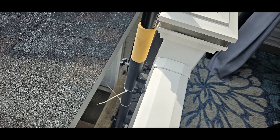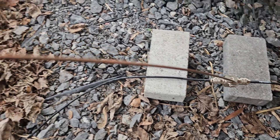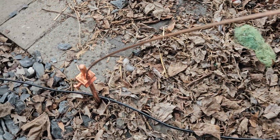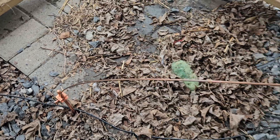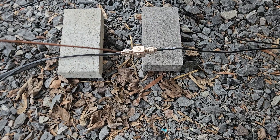Last on this is grounding. This is a ground we have set up — it is a copper rod with a lightning arrestor in it. That lightning arrestor connects into the ground rod and will send lightning downward if it were ever struck. One of the best ways to also protect yourself is just disconnecting your coax cable.